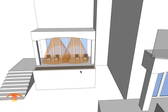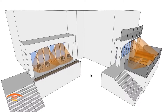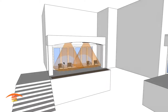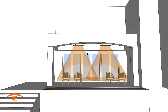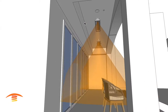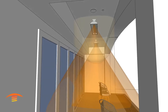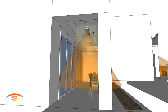This is Southern California, so I don't think it gets cold enough to worry about insufficient heat with the 5000-watt units at that height — which is 10 feet 1 to the ceiling. I have these again at 8-foot centers from each other. They are centered in the space, which is a 4-foot opening, and you can see we do have the clearances — no problem with the heaters mounted in the center of the space.